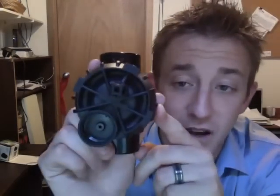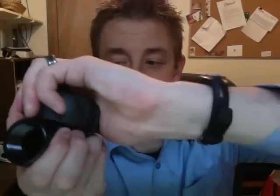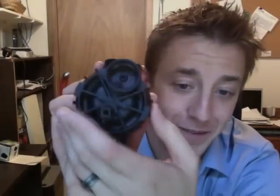Okay, so you got your valve. The difference between this valve and the valve in the video is it's still a Rainbird DV100 1-inch valve. The difference is that this is a jar top and the one in the video isn't. Hence why you don't see any screws. So to take off the top of the valve, you simply unscrew it like you would any jam jar.